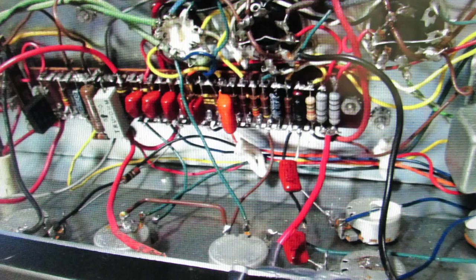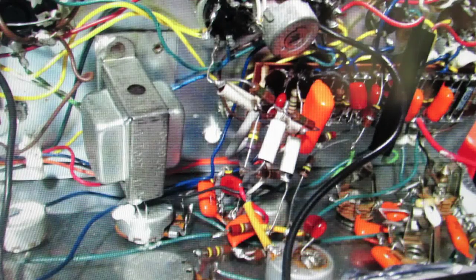So that's the inside. But yeah, the biggest thing that I did was taking out that second tone network, getting rid of that on the stage previous, and also beefing up the early stage with those capacitors, and trying to hunt down the pop that was occurring whenever I would hit a low note. Was really easier said than done.